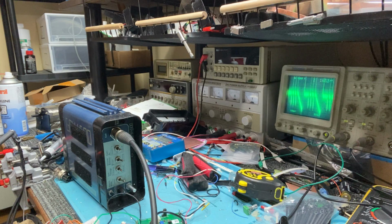and you see those lines on top? That's the flyback. But because all this circuitry here is open and, you know, all iggly-piggly all over the place, it's picking up the electric field. If I actually point this at the circuitry, the flyback will really go completely nuts. If I put the coil halfway in like that, I can nullify it. And this is something to do with it also coupling in magnetically. For some reason it does this. It's really weird.